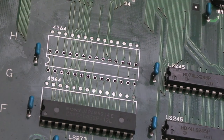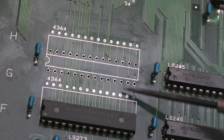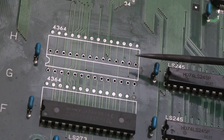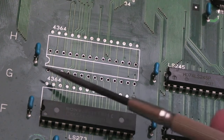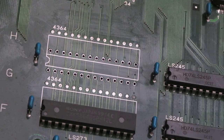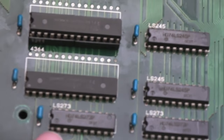I'll show you quickly on the next one what's required. I'm using my desoldering station here just to help - it's probably better because it's temperature controlled. These boards need a bit more heat but not too much because the pads are very small. If you don't use something higher than the 15 watt sort of iron you typically use, the heat doesn't transfer through properly and it can be difficult to desolder on the top side. No damage at all to that chip. You can see it's socketed now - I've had to join two 14-pin sockets. So we'll get the other chip off.